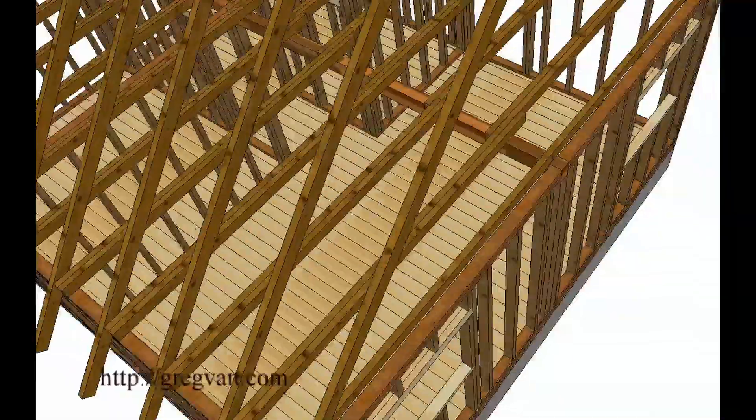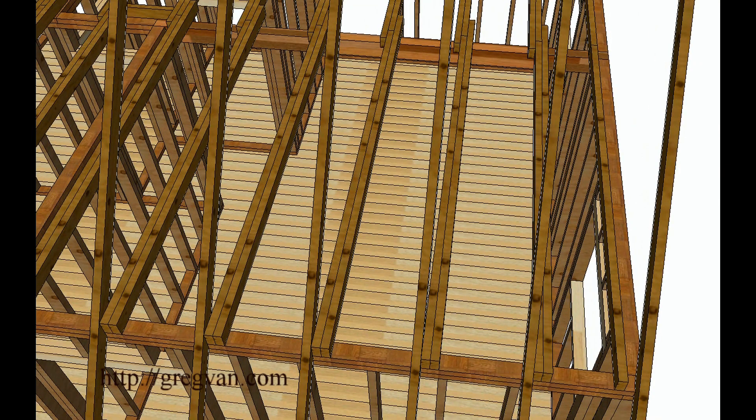Keep in mind that nailing a new joist to another joist, whether it's a 2x4 or 2x6, could actually damage the ceiling. So if you're using a nail gun, some type of pneumatic nailer, it's probably not going to be as big of a problem. But if you've got a hammer and you're driving nails into these boards, you could actually end up with some cracks in your ceiling.